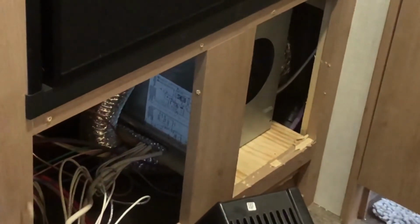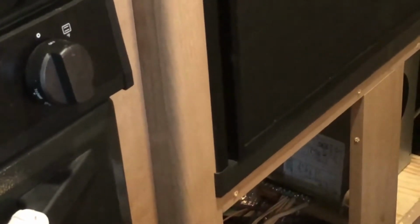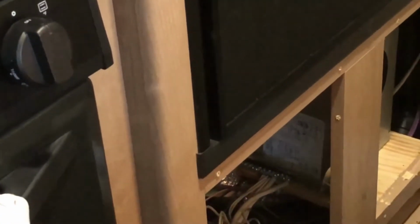In about 10 seconds, the sail switch should engage and allow the fuel to come in, and it should ignite, and that's what should happen. But if your fan is going, and after 19 seconds the whole thing just shuts down, which will happen here in just a minute, then you know there's something wrong with your sail switch.